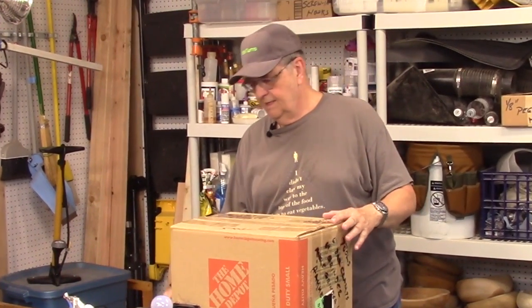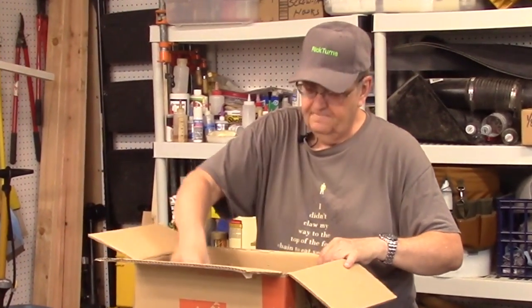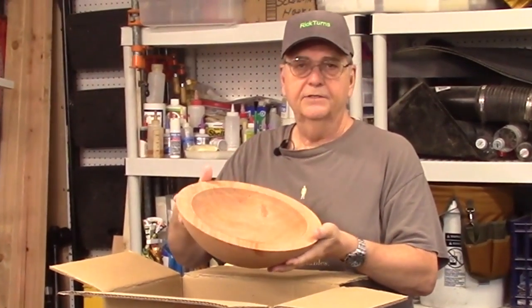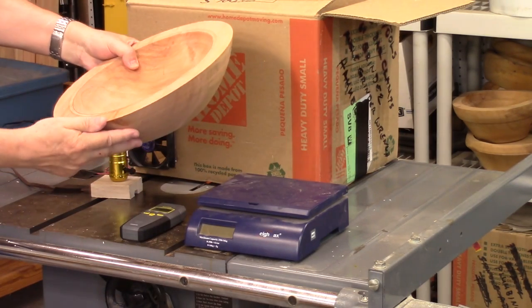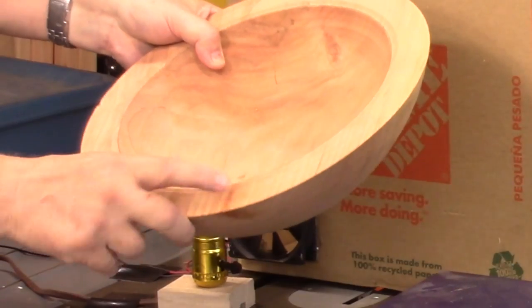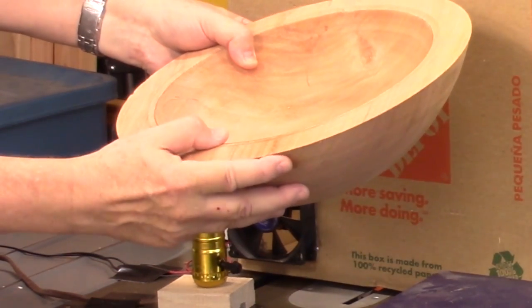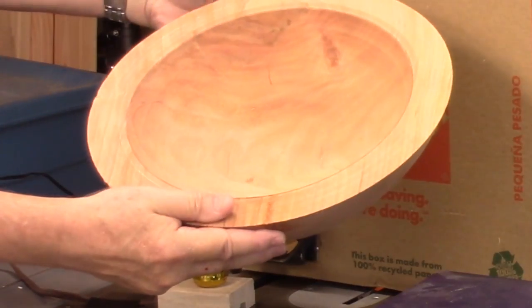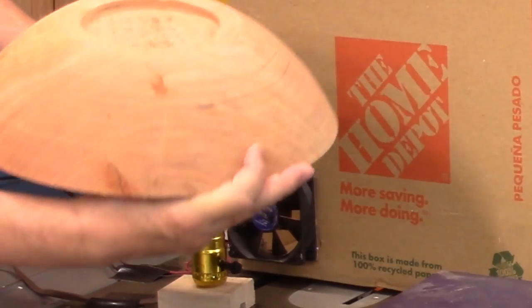Let's take the bowl out — and thank goodness, no cracks. I've gone around this completely and there's only one crack, which actually occurred before I ever started drying it. I had put some CA glue on it and rubbed some sawdust in — looks like it's held. There are a couple of sap streaks but no new cracks. I am quite pleased.